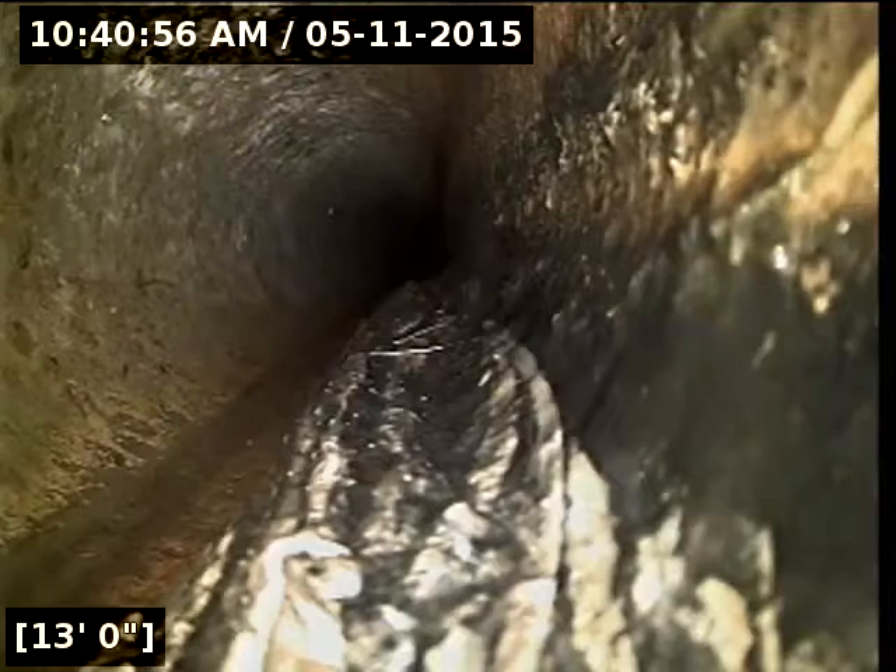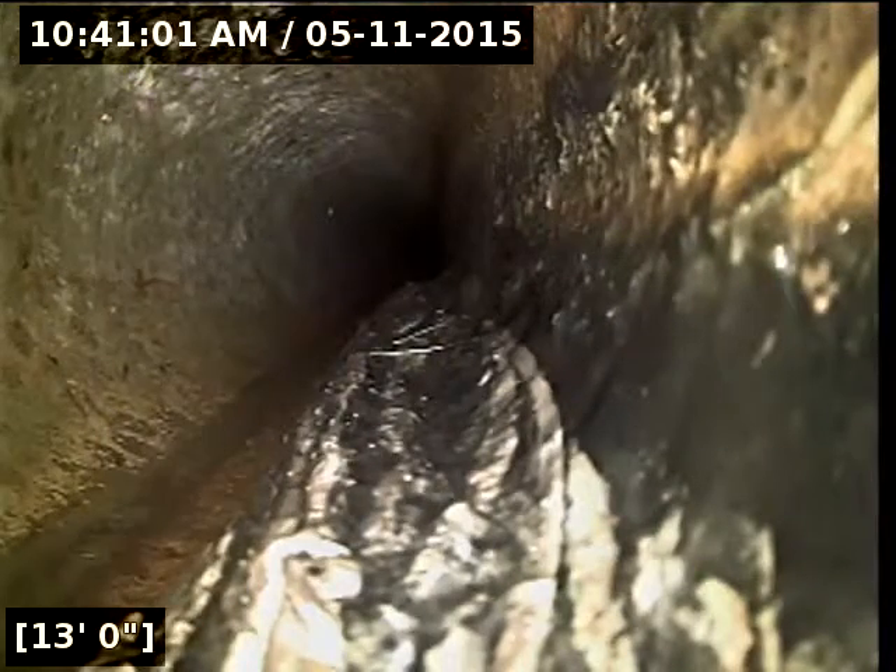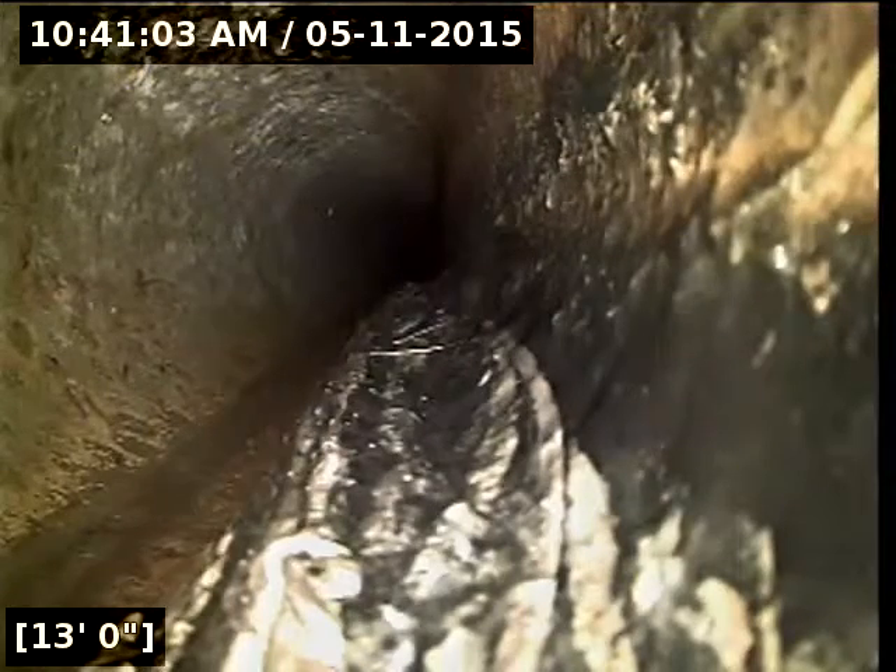I did successfully locate right here at 13 feet out, marked with the green X, and it's right around three feet deep. There are a lot of logs and ground cover so the depths may be off by a little bit — anywhere between two feet ten inches and about three feet deep. I'm going to pull back to the beginning and reel back to the cast iron transition. I'll put a green T there — the T indicates the transition from cast iron to concrete — and there's a green X at the end of the repair.